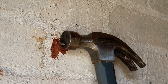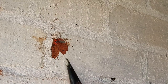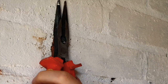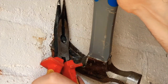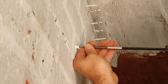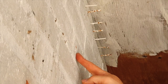Now on a tricky little sucker like this where I've actually been trying to use the claw hammer and it just is not engaging at all — all it's done is tear the threads off. All you need is a pair of pliers. They don't have to be long nose like this, but so long as they've got the cutting section in there. You need to bite into it slightly, then get your claw hammer in behind, and then hopefully a combination of the two — success. Don't tell me there isn't something satisfying about that.